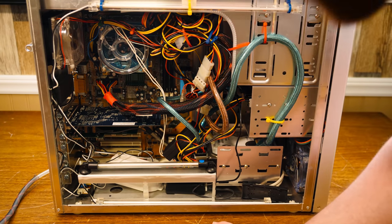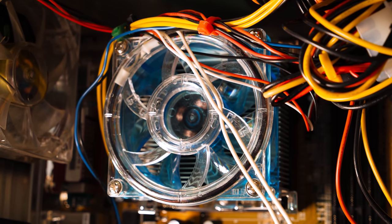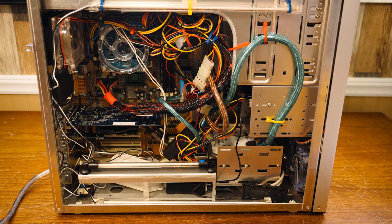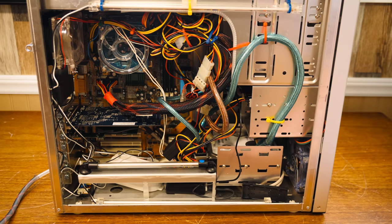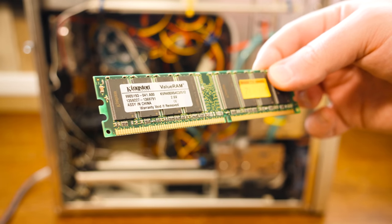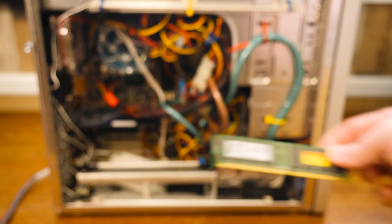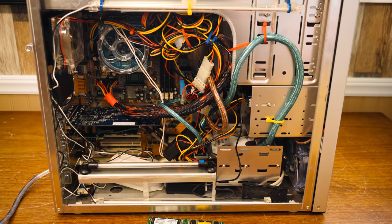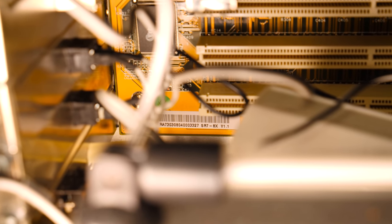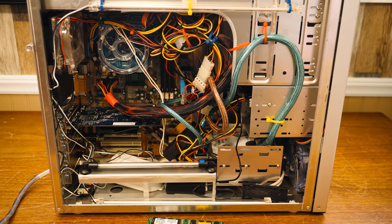I have doubts this will work without a recap, and a lot of times these just are not worth recapping. I'll do my best and try some things. In terms of the CPU, probably Pentium 4, socket 478 or thereabouts — maybe an Athlon XP, you never know. This looks more like an Intel board. The RAM is classic Kingston Value RAM, DDR 400, 512MB. And I just spotted the motherboard model number — it's an Abit SR78X, socket 478, not a particularly great board.